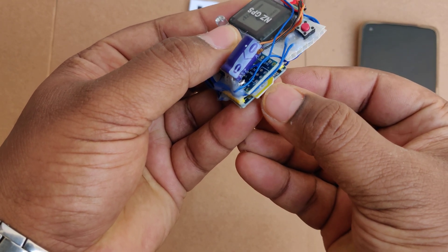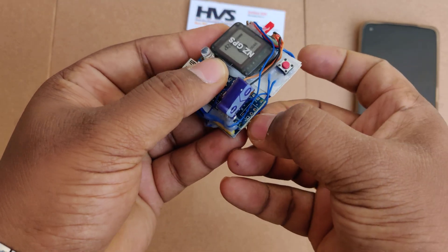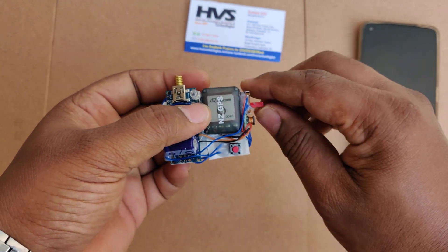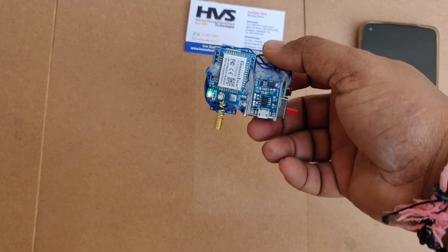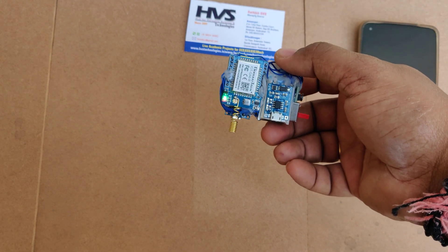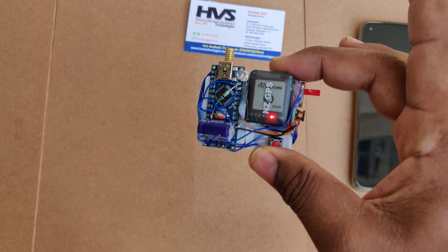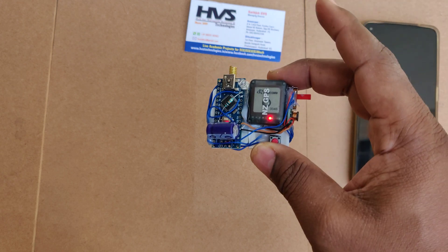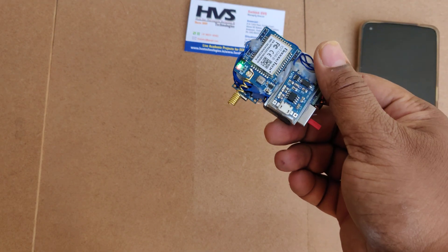The inserting procedure — it is better to use a mini SIM, not a nano SIM. The slot is push-to-lock and push-to-unlock: push to lock, push again to unlock. Now turn on the power supply and wait until the GSM modem and the GPS get their signals. When demonstrating under open sky view, it will provide live location values; otherwise it will show zero-zero as the GPS cannot get satellite visibility.